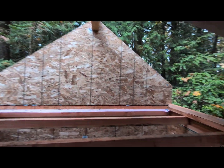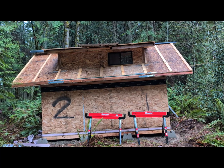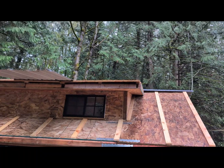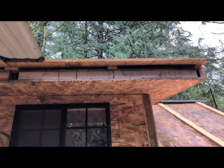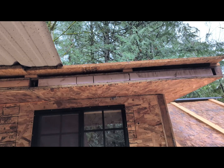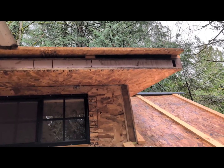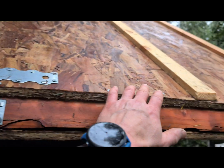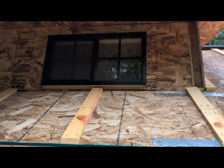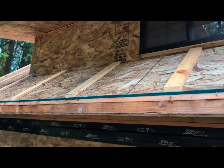I've now framed out the majority of the building. I've put a second layer of OSB on top — the Advantech roof, actually a Zip System roof — creating a cold roof with air gaps and stripping underneath. There'll be a filter there to let air come through and circulate to keep it cool. I noticed the window was going to be mounted too low, so I'm glad I only did one — I'll bring it up and move on to the next step.